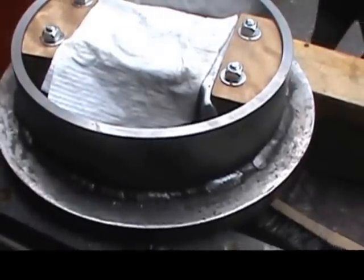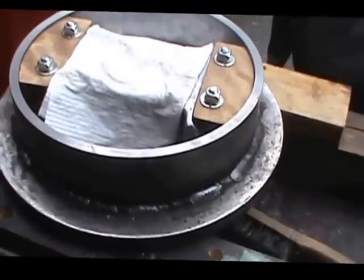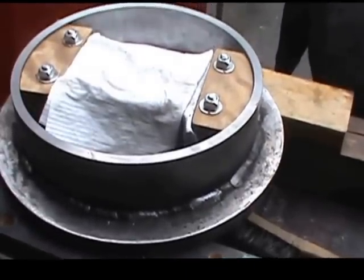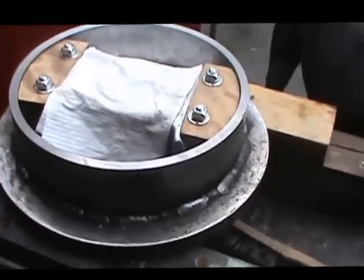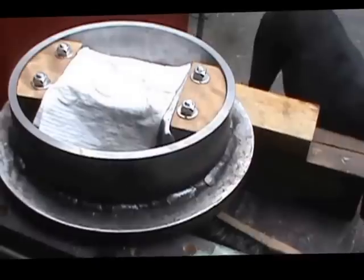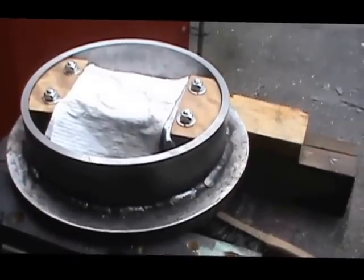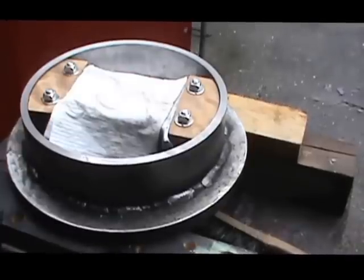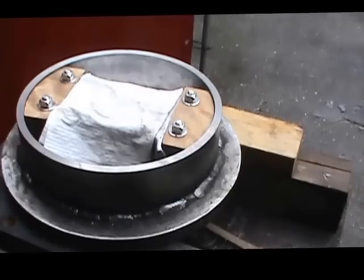So far so good. Everything's looking good. One piece left to go on it, and it'll be ready to move up to the hammer. At that point, all we'll have left to do is mount it on the machine, drill a couple of Dutchman screws to lock it in place on the shaft, complete the fabrication of the shift linkage, and we'll be good to go.